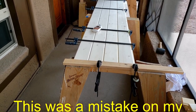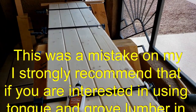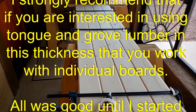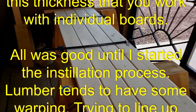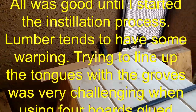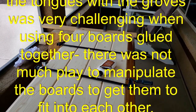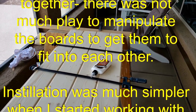Once Melody's done the initial sanding and filling, I bring four boards out onto the front porch and glue them up using transparent wood glue, which makes staining so much easier if any seeps out. I run a little down the grooves, stick them together, and put four clamps on with barely any pressure — I don't want to mess up the tongue or the grooves. I set up stop blocks at each end so I have nice even edges when I'm done. I think doing four at a time — maybe five would be better, but I just don't have clamps wide enough. When it comes to putting them up on the walls, I'd rather do panels of four than individual ones time after time.